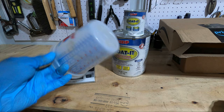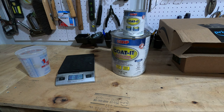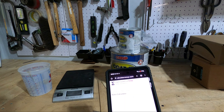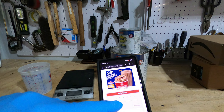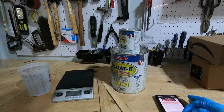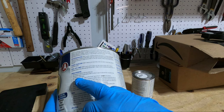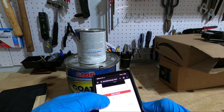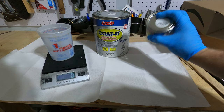All it is is a ratio — the ratio is right on the bottle. Go to Google, search for ratio calculator, type in the ratio, type in how much you want to make, and it tells you exactly how much to pour. You're going to need a clean container to mix it in, a scale, your epoxy, and something to stir with. For Coated specifically, the instructions say mix seven parts A (resin) to one part B (hardener) for small quantities. With everything shaken and ready to go, I have the scale zeroed out with the cup on it. Coated is a lovely dark gray color.